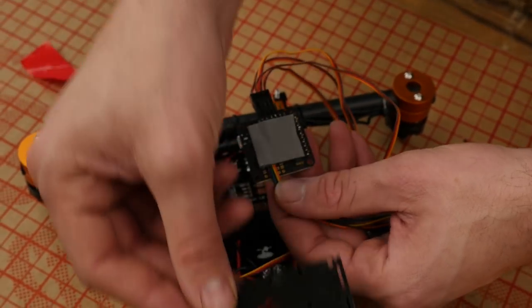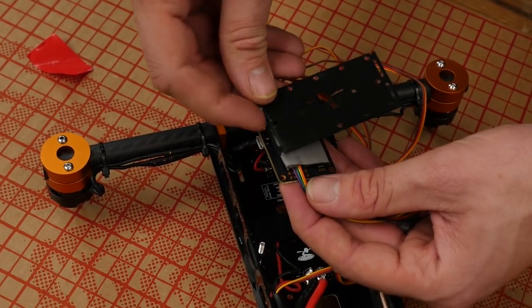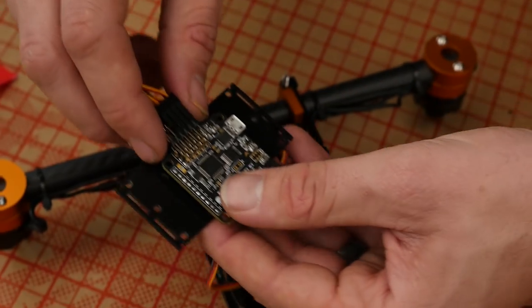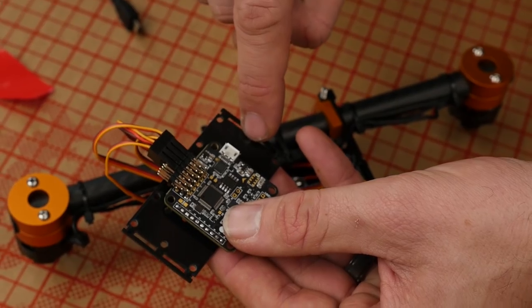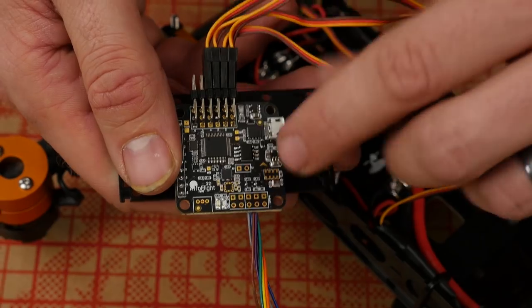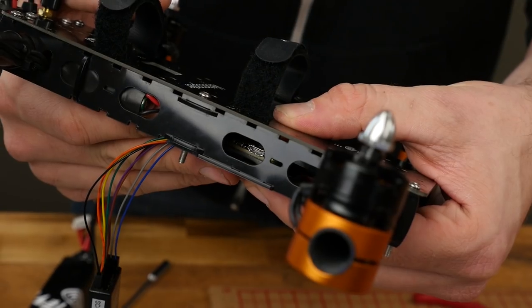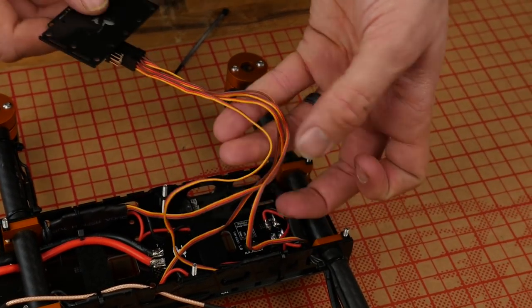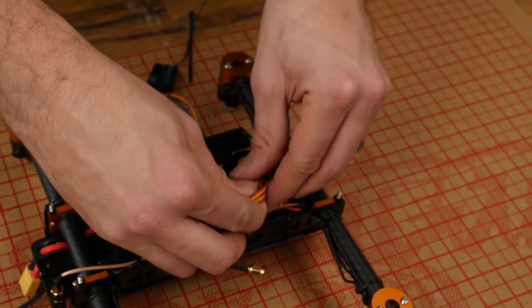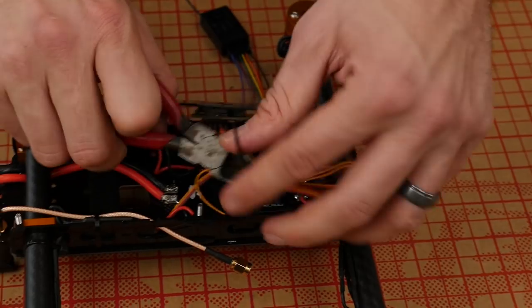Use a little marker to make sure you can orient the bottom and top of the Versacopter. Line up the USB with the center dot, find the very center of the control board, confirm positioning for USB access and center alignment, and press it down. Make sure the arrow is pointing towards the front of the Versacopter and press it into the notches. When you look through the side, you should have easy access to the USB connector. Route the wires neatly, keeping them away from between the USB and sidewall. Fold the wires and add a zip tie — design it so you can do field repairs easily.